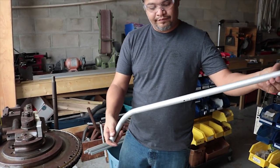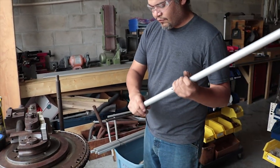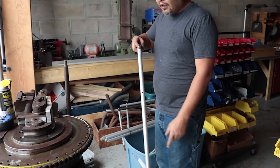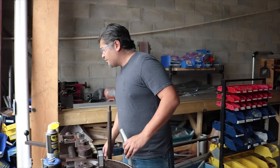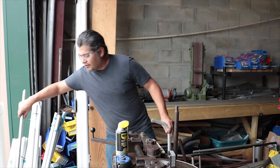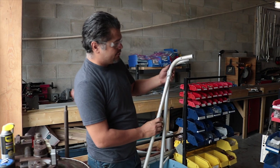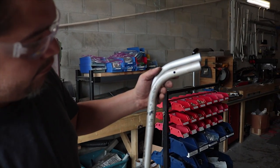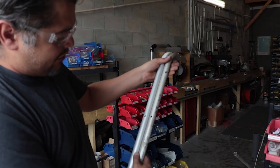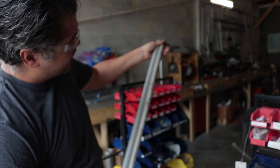Now, aluminum or any metal has some type of spring back, correct? So do you factor that in when, in the build, or you have a template you use? Yes, we do have a template, a master part essentially. We can bring everything up to show that the bends are the same. Okay. Same thing to reference where the holes are and all that.